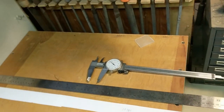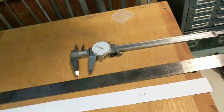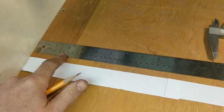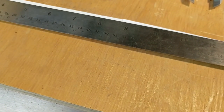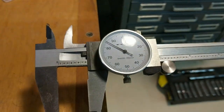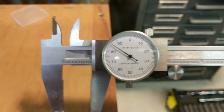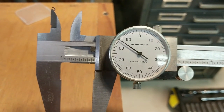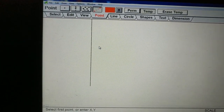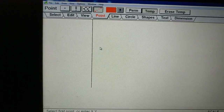Now, if you're like me, you don't have a precision caliper that's this long. But I do have a printer's steel rule. I lay the rule on here very carefully, lining it up at the end with the mark — it was 19.7 something. Then I overlay the caliper from the 19-inch mark out to the end of the paper, and the answer is 19.785 inches. So in my CAD program I have drawn a line that's 19.785 inches high and placed 99 division points within it.